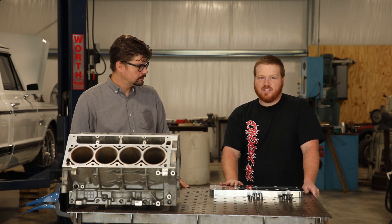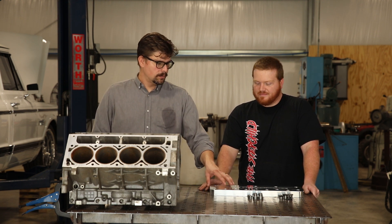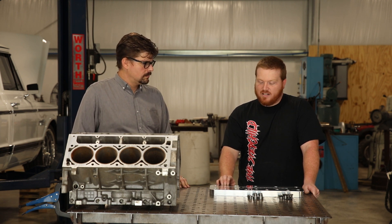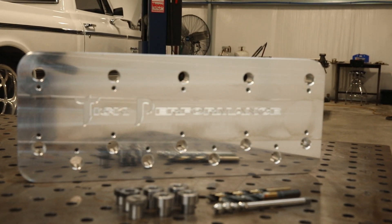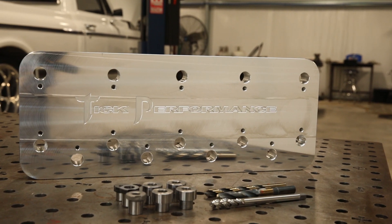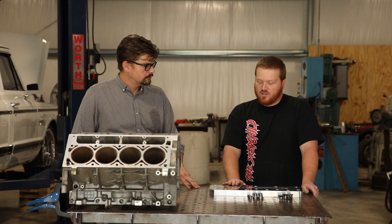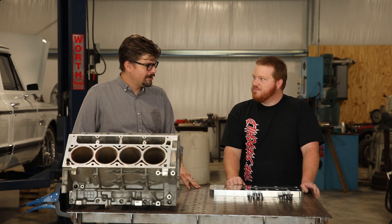The drills and taps I've used on four blocks now, start to finish, and they're still going strong. The plate is made from 6061-T6 aluminum — we get it as raw stock and then machine it until it's perfectly flat, perfectly symmetrical, and we bore holes that are precise to allow for a precise fit. This is all done in-house on our CNC machines. The finished thickness is one and a quarter inch.